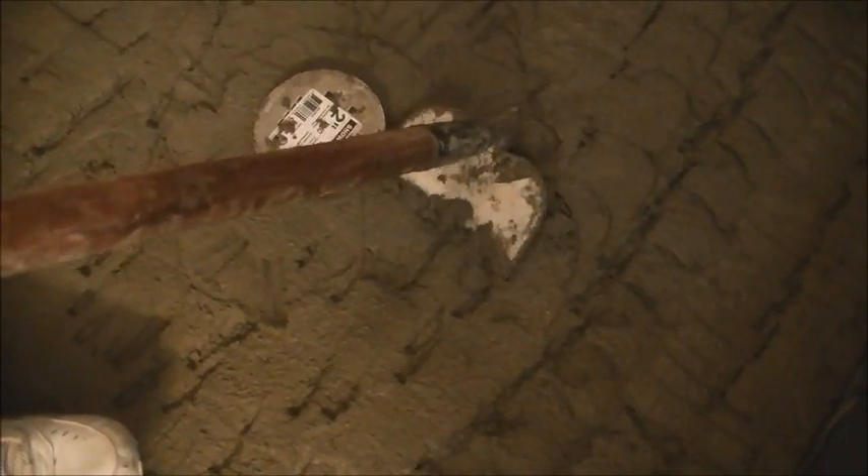Getting up around the drain is relatively easy — same thing with the hoe, or a short piece of 2x4. You just want to push up under the drain lip and push everything down underneath it. Sometimes it's easier with my blade. The point is no voids — you don't want any voids in here whatsoever. I'll go over this about three times, switching directions, so it takes about five more minutes of tapping down before sloping it to the drain.